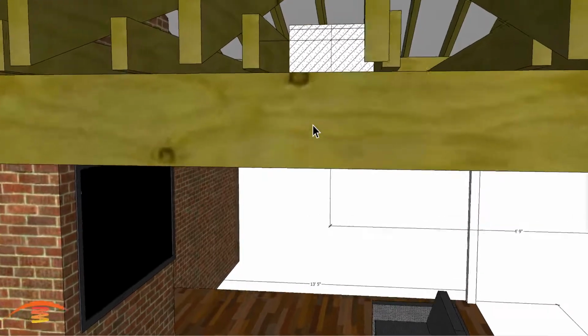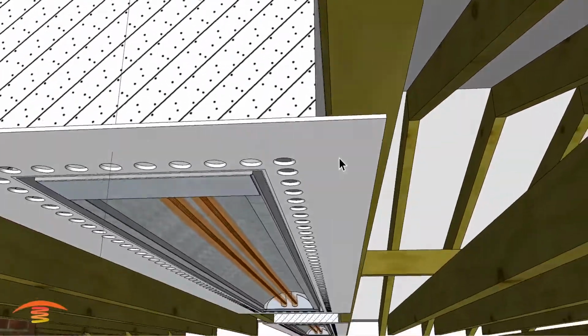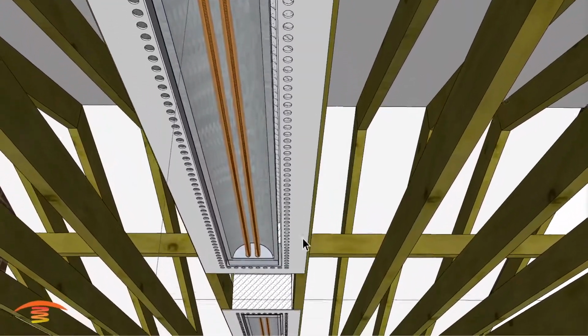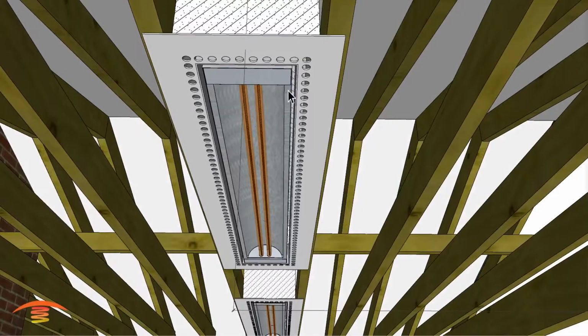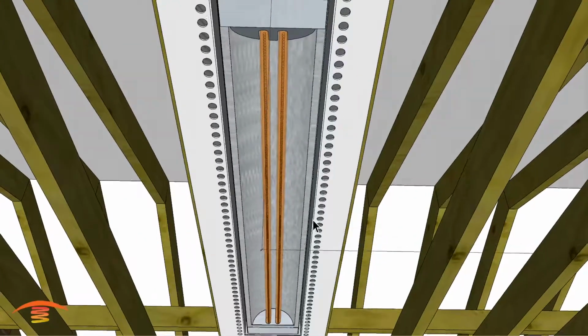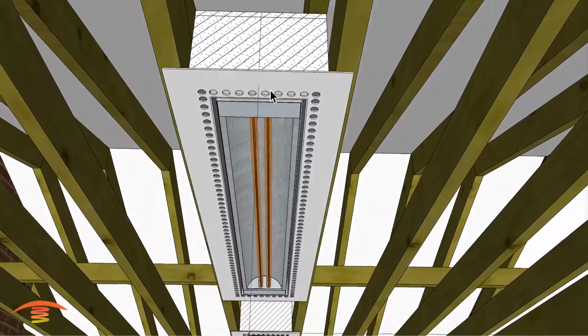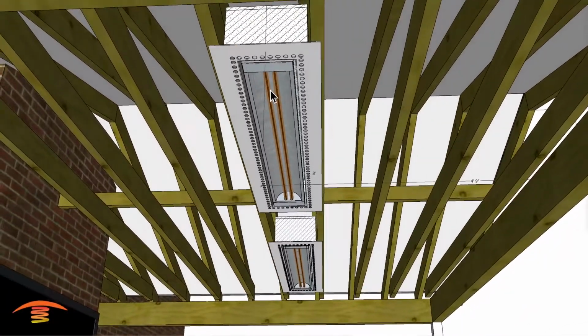So I just moved it in 9 more inches. Now I could push it all the way to this edge, but that's just going to give me maybe another inch, but you could actually do that. The other thing I want to mention is that with the flush mount frame, you can attach this frame to the studs, so you could drill a hole here, here, here, and then the same on the other side, and mount it onto the studs themselves, and then the heater itself rests inside the frame. That enclosure should be built before you install the frame. Just a side note to that. Okay, and let's see if there was anything else.